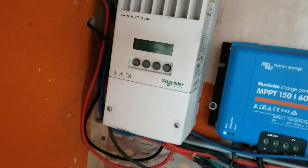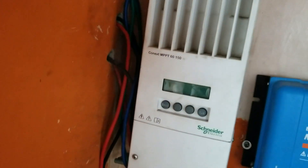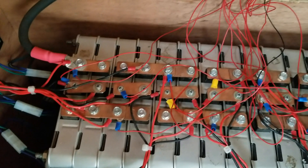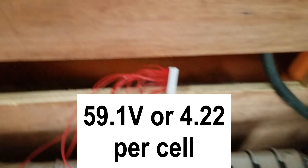Hello YouTube, this is Dr. Solar coming to you from Lagos, Nigeria. A few days ago I noticed that my batteries were overcharging. I have my Nissan Leaf which is supposed to be maximum 57.6 volts. I was getting to 59 and change, which is not good for these batteries, and as you can see my BMS is disconnected — it didn't stop it, it exceeded the numbers I had set for it.